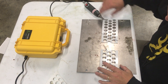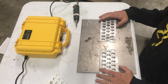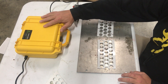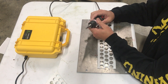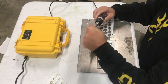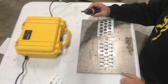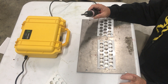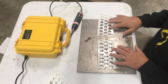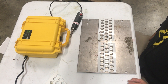I'm going to do a brief demonstration on how to use the AMT sonic welder to splice together a perforated poly egg belt. This is your power source, this is the gun, and we have different tips for different situations — tips for different thickness on the perforated belt, a tip for manure belt, and a tip for woven egg belt.